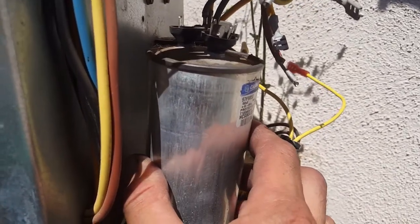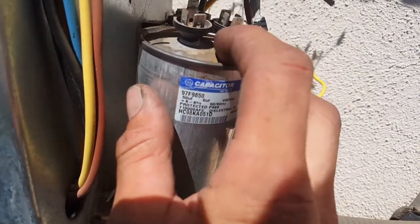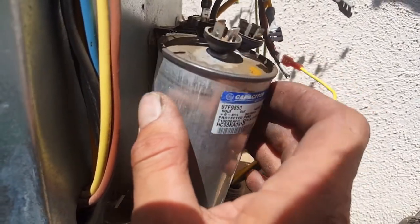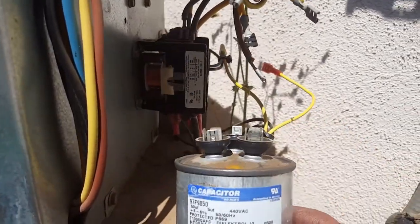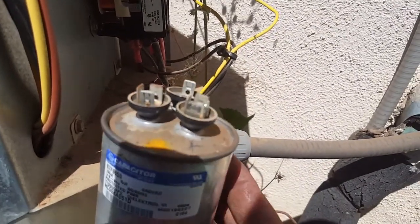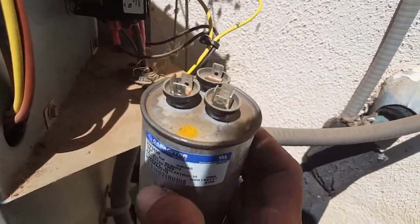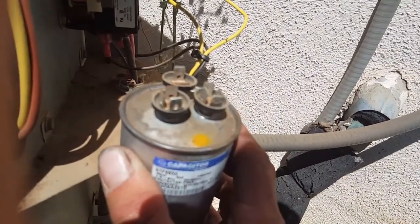Other than this stuff here, you just got the two motors. So we look at this capacitor, and usually they're flat on the top — and this one's kind of bubbling. So the next idea is we'll do a change of capacitor. Now, there's a way to test these with a voltmeter, checking for microfarads or using capacitive resistance. I did check, and this thing's pretty much dead.